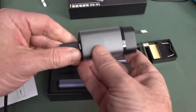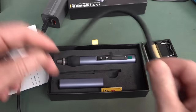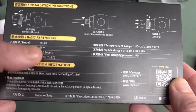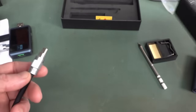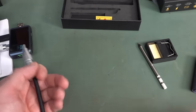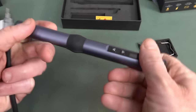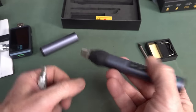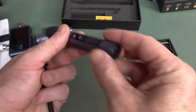You get what I think is a 65-watt USB adapter, as well as the sexy metal silicone cable. It's supposed to be 65-watt power, but that will depend on the capability of your USB battery bank or whatever, because you're not going to use this thing with a plug pack. The whole idea of these portable irons is that you can use them out in the field. It does come with a nice little thing to protect the tip — screws on — and it's all alloy case. Feels really good.